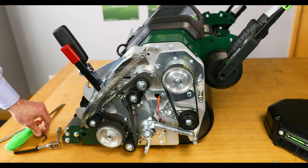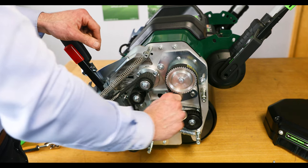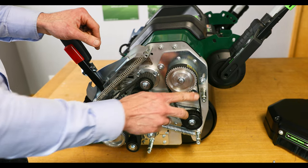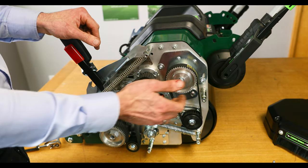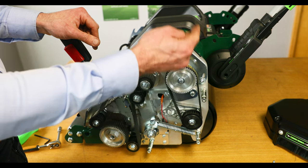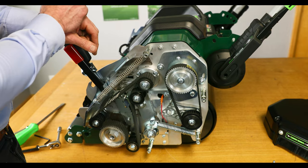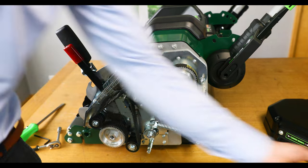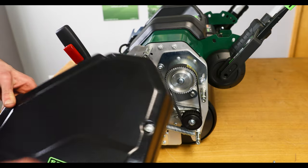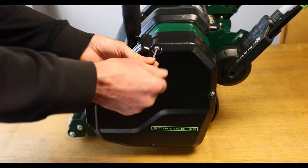So that's our belts replaced. The same principle applies if the belt has stretched at all and you just want to add more tension — again it's just release those two fixings and then use the pry bar section underneath just to raise that top motor so you can put some tension on there. Now we're going to reinstate the side guard and we're ready to mow.